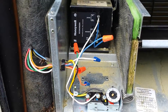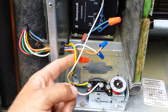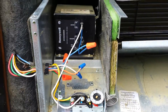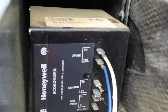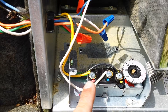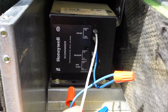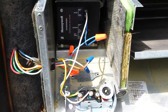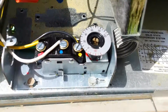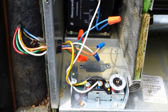Here's the end result. The wires that were coming over here are capped to the relays. The economizer motor is stroking open — we are sending power from the red to the blue, which in turn is driving that damper open. And if we drop that temperature setting back down below the outside temperature, after a time delay inside the unit, the compressor will come on.